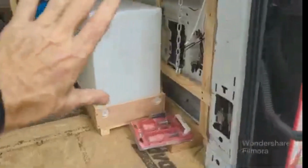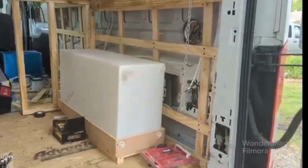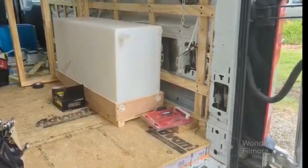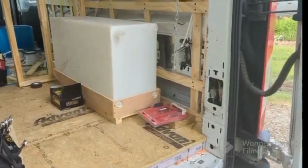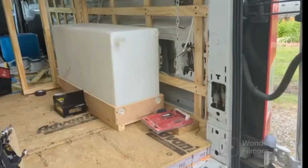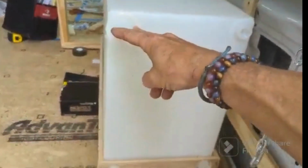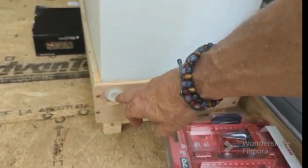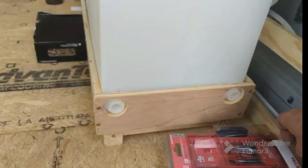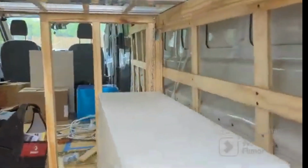So I will put a little wall right here in this area, and then we'll be able to put a shower manifold, an Aquor fill line. I'll have the drain line connect to the back wall here that we can just put a little hose on to drain it. And then we'll have storage for any of the water supply equipment. So then we'll have a 1¼ inch fill line going into this point right here. And then we'll have the Propex PEX A coming out of the supply line, going along the wall here to the pump and accumulator, which will be right above the tank.